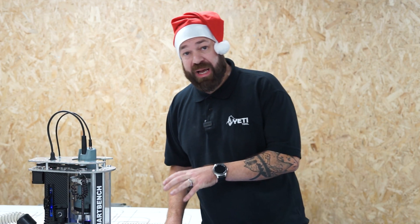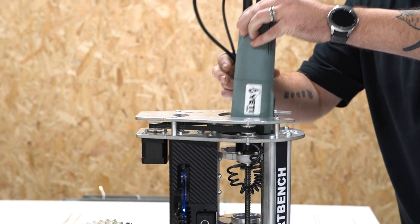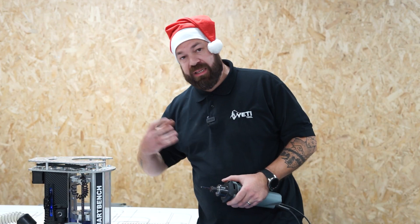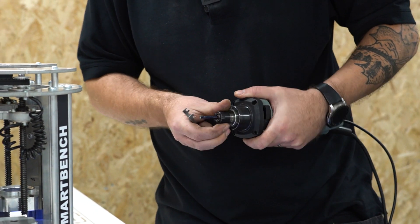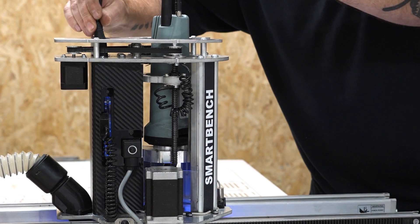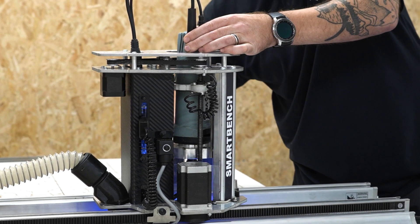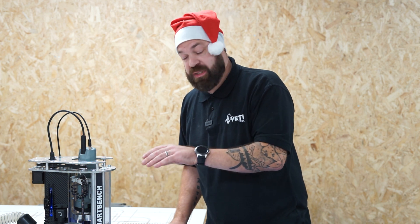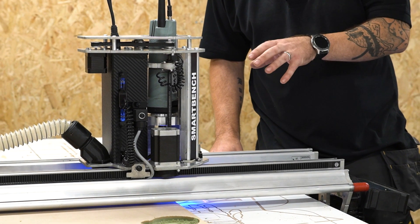That is our second clearance pass done with the 6mm bit. At the moment it looks really rough because we've been using some upcut bits just to bulk out the material. I'm now going to swap over to a 60 degree V-carve bit and all of that detail is going to start to come to life and clean up a lot better than these upcut end mills. The first toolpath ran in around four minutes and the second in two minutes. This is probably going to be the longest toolpath, with all the nice V-carve detail to add. We've got our tool mounted, we're ready to reset our Z calibration for the V-carve bit and run our third toolpath.